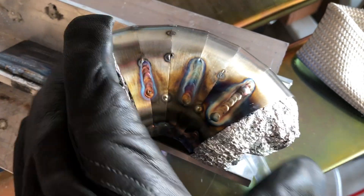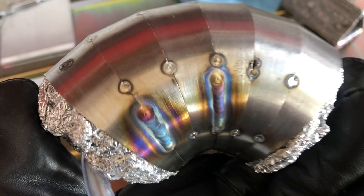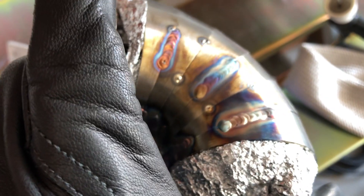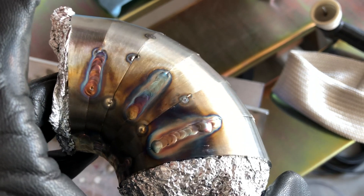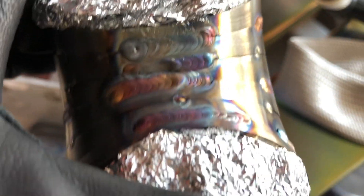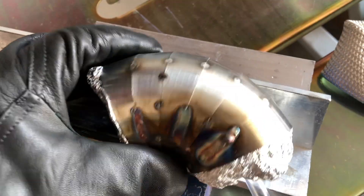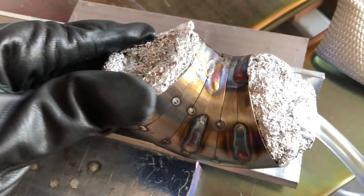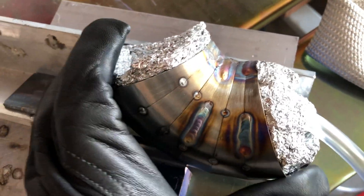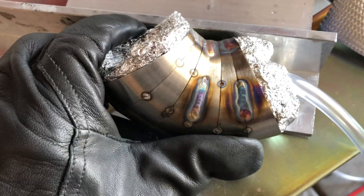This is all progress and things can only get better. I'm trying to get a more consistent motion with feeding the filler rod, moving around the piece rather than welding just one side, so it doesn't shift. Just trying to get some consistency going and not staying too long and cooking the metal. This process was probably several days because I'm in Arizona and it was really hot in the garage, but in video format it's only a few minutes.